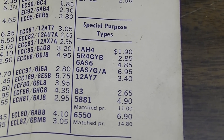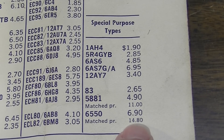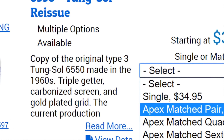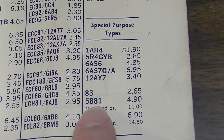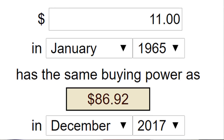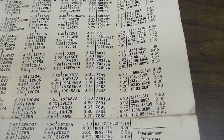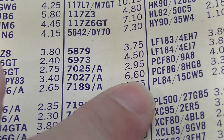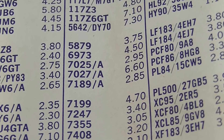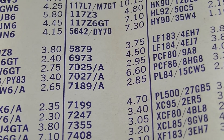Over here in Special Purpose Types, they have some of the other main tubes we're used to seeing. 6550s would bring $14.80 for a matched pair — the 6550 is more or less an industrial alternative to a 6L6. 5881s — the Tung Sol 5881s are very, very good tubes — were $11 for a pair. A 7027 could be had for $6.60, but the regular 6L6GC was $4.35, while the metal can 6L6 was still $8.60 — $2 more than even the industrial glass bottle 7027. That's just weird.